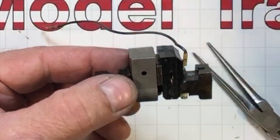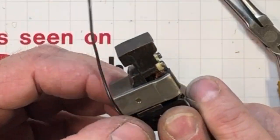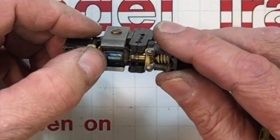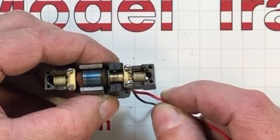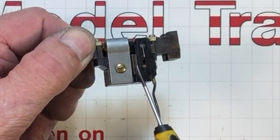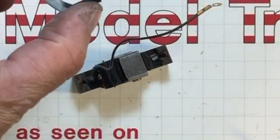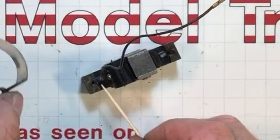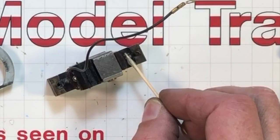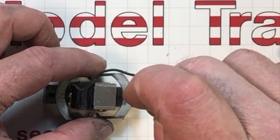Install the magnet and the side magnetic pieces, one bolt, line it all up — that holds the whole thing together. Make sure everything is square, straight, flat, and nothing's dragging. Check that the armature spins freely. Important note: don't let the metal plate touch the metal frame or it will short the whole thing out. The gimbal mount sits in here but has some wear points, so I give it a little Super Lube multi-purpose synthetic grease — just a tiny amount. The small screws with washer heads keep the gimbal gimbling.